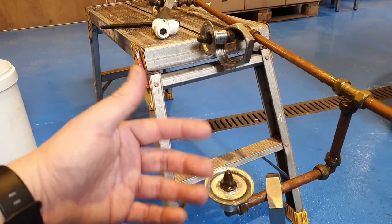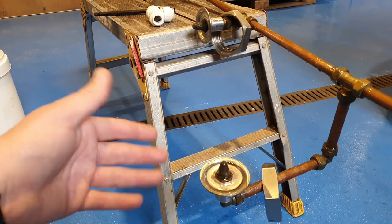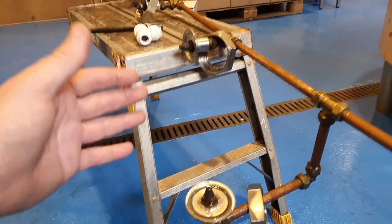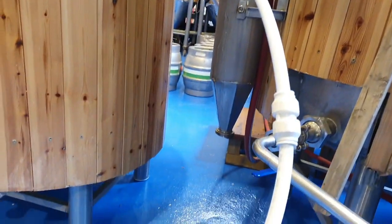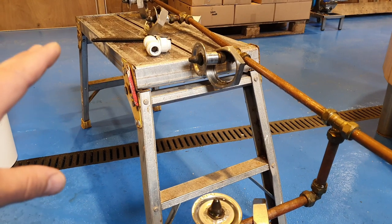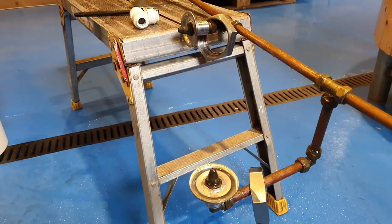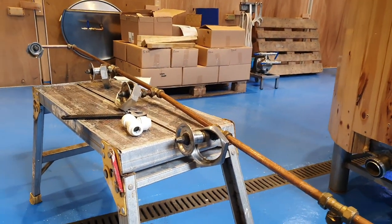It's got a positive feedback loop. So the more steam that's cooled, the more steam is drawn into the cooler. And it really, on the kettle itself, can produce quite a downwards draw at the bottom. And the good thing about this system as well is it's relatively low on waste water. So we've clocked it at about 3 liters per minute over these 5 jets.